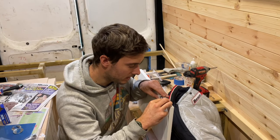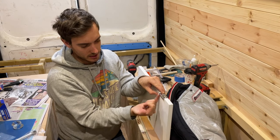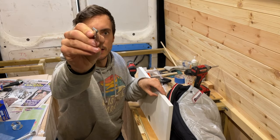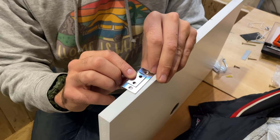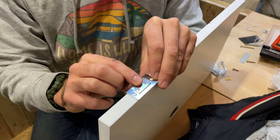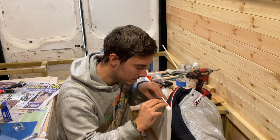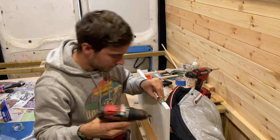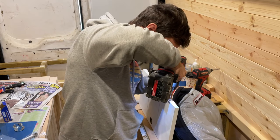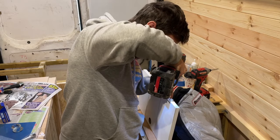If we get that in the centre, we've then got that in position. Now what you want is this side here, which is actually curved — we want that side to the front of the door. The reason is that's going to locate it, it's going to stop it from pushing back, and I'm going to show you how we're going to get it lined up with the top of the door. So let's get that in the middle and then all we're going to do is take a small drill bit and going in the centre of those holes we're just going to pre-drill.